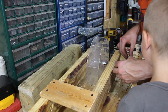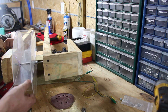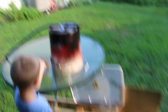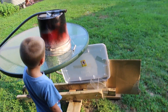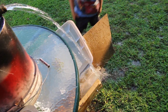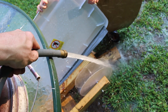Put the pulley on the big one first and then on that one. We might have to put a bigger pulley in here — depends what we see. We're going to turn on the water and see what happens. I'm afraid we're going to need a bigger pulley down there. I don't know if we're going to get our speed. This would be about the height and amount of water coming out of the tube that we'd be using — it's coming off a pond. We're not going to get quite this speed when we're down at the creek, so I think we're going to have to make a bigger pulley.